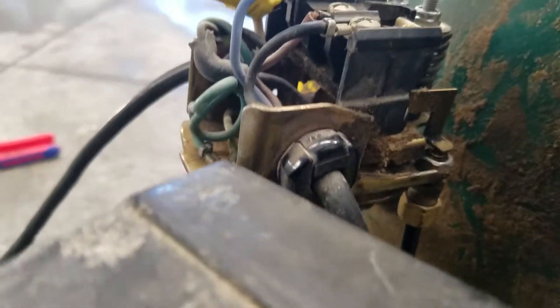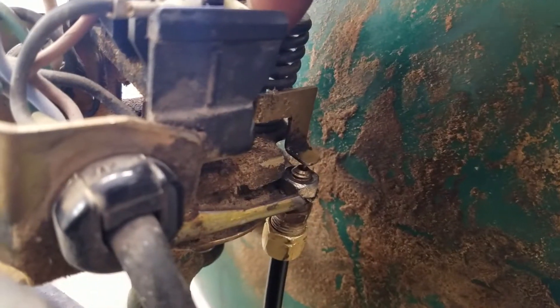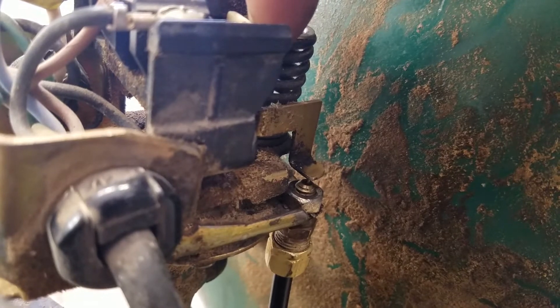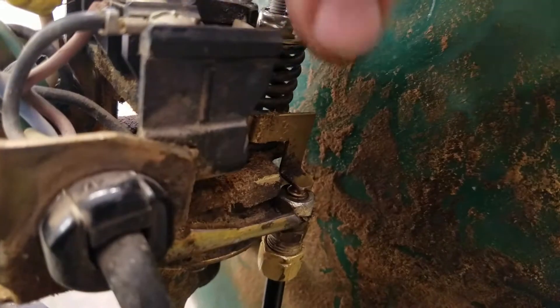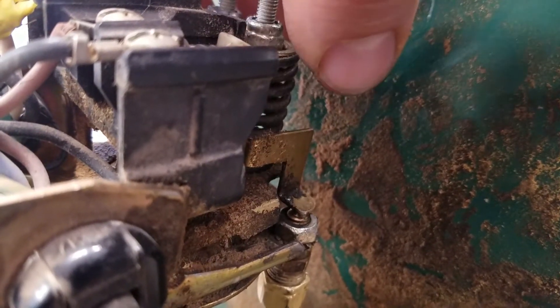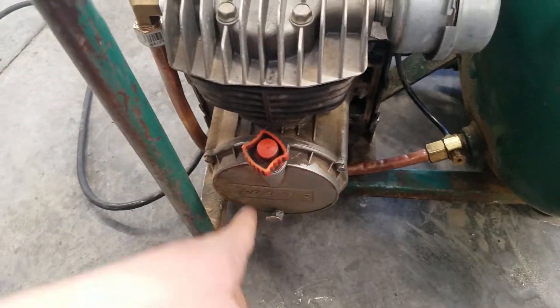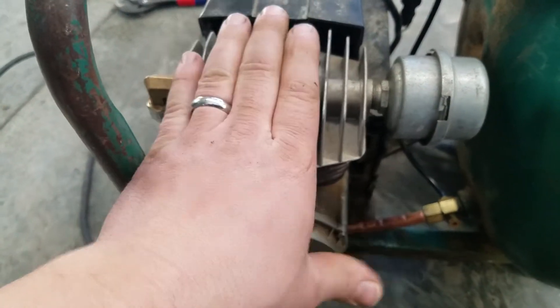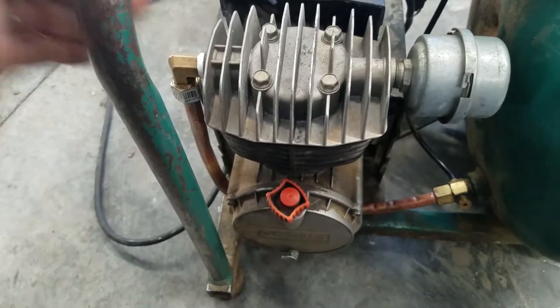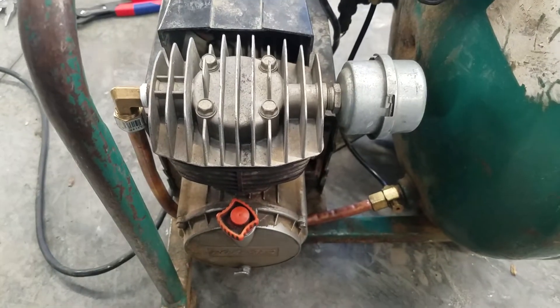By pushing all the air into the tank it basically compresses it and holds it inside the pressure tank. This little plastic line comes over to the pressure switch. When the pump gets satisfied and the pressure switch turns off, it presses a little pin down there controlled by a spring. When that pin goes down it releases pressure from the back end of the system — off of here and out of the cylinder — and that makes the pump turn on easily at the next startup, since with no pressure in there it's easier for the piston to go up and down.